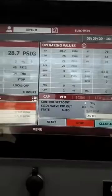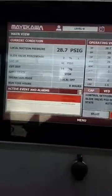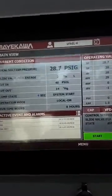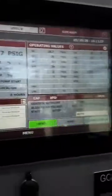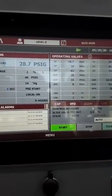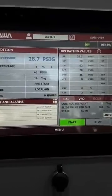So let's fire this baby up and see which way she goes. I'm going to clear some safeties here on this machine — clear the active e-stop and clear the alarms. We're going to turn this baby on. Right now we're going through a four-second countdown; after that our oil pump should be activated. Oil pump's going on its countdown — you guys may have heard the oil pump come on. In seven, four, three, two seconds — compressor's coming on.